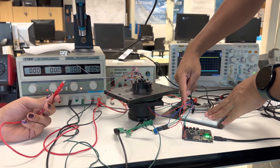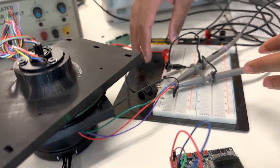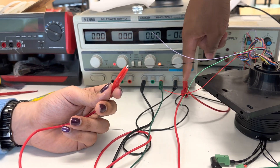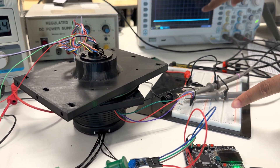We have a whole bunch of resistors pulling the lines on this bottom side to ground. We are powering this whole thing with five volts across these two rails, and what we're looking for is on this side we're actually pulling these up directly up to five volts. So if there's any disconnect between here, we should see these guys fall to ground on the oscilloscope.